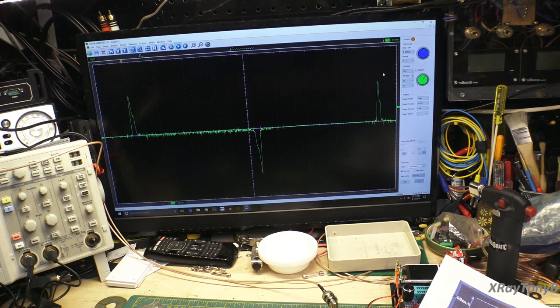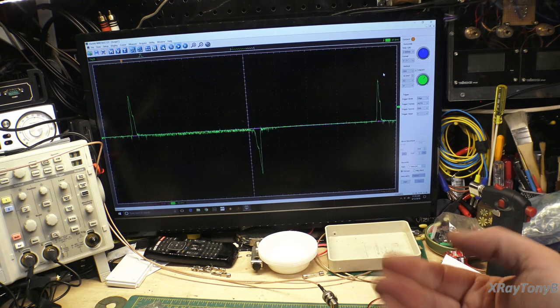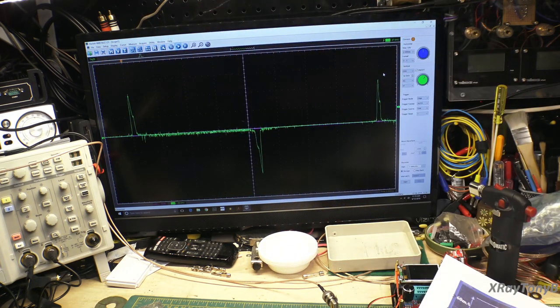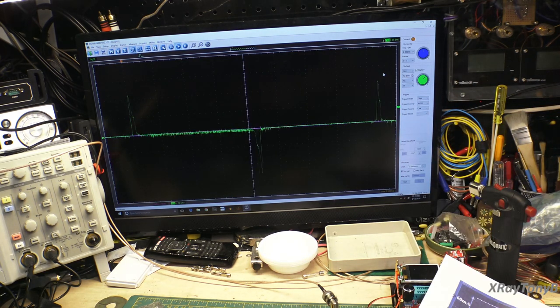And I've compared my results with my curve tracer and with my Peak Atlas, and it seems to correlate with them. But more importantly, because this is putting such low signal on the transistors, I can leave this on for a very extended period of time, and I can test these transistors over time. I can also look at their thermal characteristics, because if I heat both the transistors up equally, they should still stay nulled out pretty well. But some of them will react grossly different from the others, and that's another thing you want to see if you're checking thermal stability and so forth.